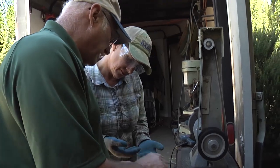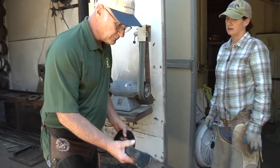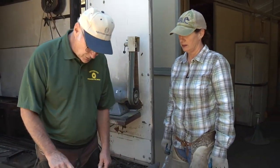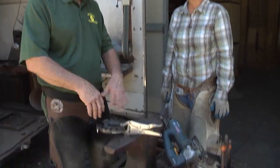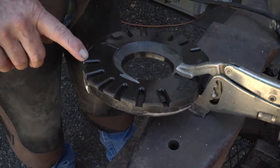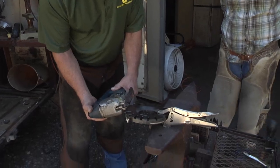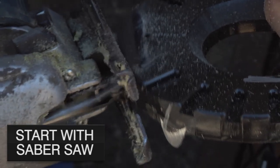So now I'm going to show you how we can rocker the shoes. Horses that have problems — ring bone, et cetera — are really addressed with these shoes because you can reduce the concussion, and the tread gives to the way the horse travels. We have the toe studs here so that they can push off without blowing the toe up. As the horses get up on that toe, they put all of that PSI right there and the plastic just goes away. Three toe studs of half-inch give the right amount of give to toe wear, and it also helps set the break-over back. So I'll do a little cut of the urethane and I can carry it around the corner.